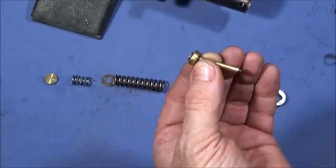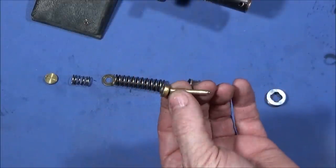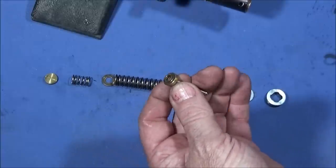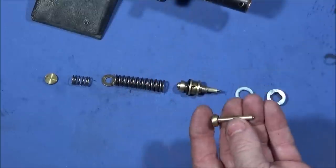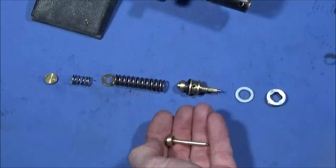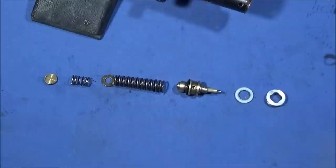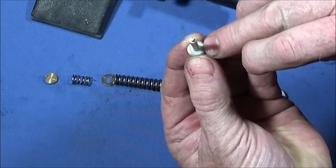And if you watch my past video on the Setra, you'll see that I actually made this part of the valve up because the rubber had hardened. I couldn't get the rubber part out. Plus it was also bent and sticking in the housing. And I tried making a rubber seal for that one and that one didn't work because under pressure it actually pushed out. So what I did was actually make a PTFE one which pushes down in this one.